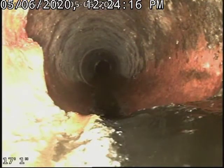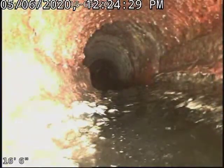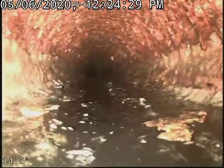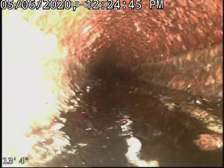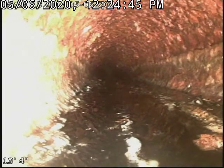We're 16 feet away — this is still outside. And you see the bottom of this. Watch as I pull out. The bottom of the cast iron rots from the inside out — the cast iron itself rots from the inside out. The bottom of yours — you can even see the ledges. So what that's going to do — if I had the laundry running, you could really see it. Look at there. Let's see if there's a pool of water somewhere.